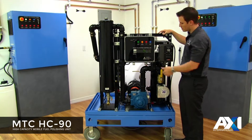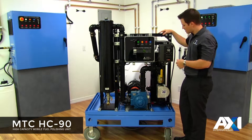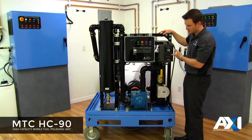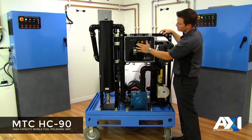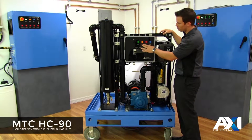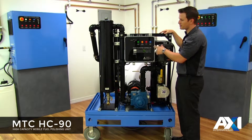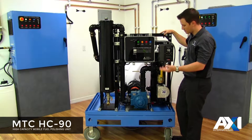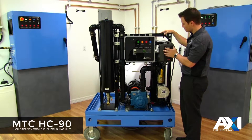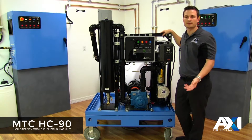Turning the unit into manual at this point, you'll hear the pump start to kick up. This unit will be down around 6 to 10 hertz, and you want to make sure that the switch is in the start mode on your actual variable drive. At that point the pump is going to start to kick up. You'll see the system power, the pump running, and if everything's clear you should see no alarms. You might need to push the reset button if there was a prior alarm, but you should be good to go. The pump will get to its full RPM for your current frequency setting and your flow rate will pick up at that point as well.